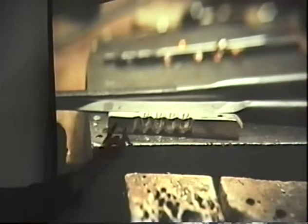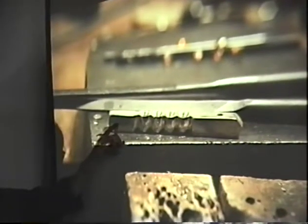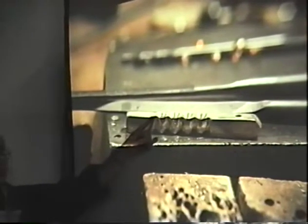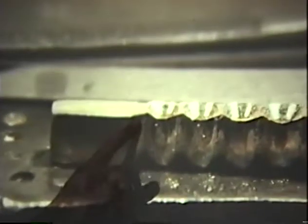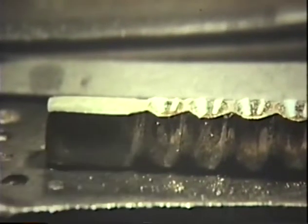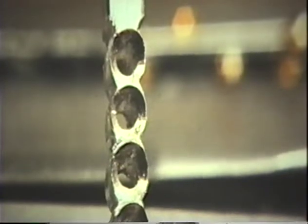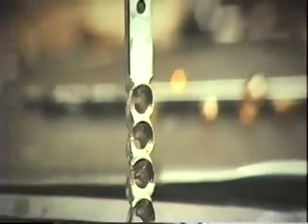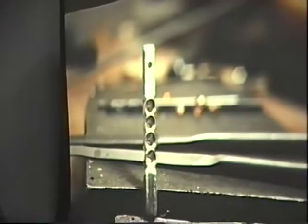Then I go to a series of different files — a half-round file to start carving around, and barrette files. Small barrette files are my favorites. I start with a number-two cut and go to a number-four cut for finishing. I carve both sides so they curve around like little cups. The fun part is the fancy carving you can do with the rest of the rod, and you also have to file this area away in order to fit the wire that goes in there.